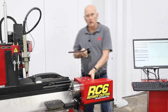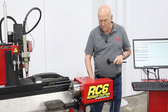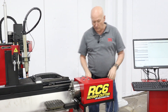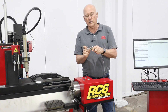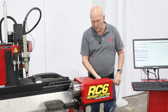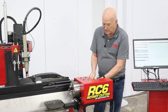Let's go down and hook up the injector. This is the water injector — it installs into the power head through a port on the rear and there are two set screws to lock it in position. Typically it's installed with the long tube running down the machine. You do have the option of flipping it and extending the water injection further into the tube if desired. The typical way is to install our valve onto the end of the vinyl tubing and then, using a short length of tubing, connect it to the short tube on the injector. I'll tighten that up, place it into the power head, get my hex wrench, line up the tube in the middle of the chuck, and simply tighten up the set screws.